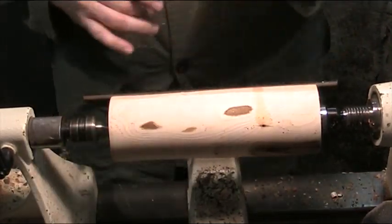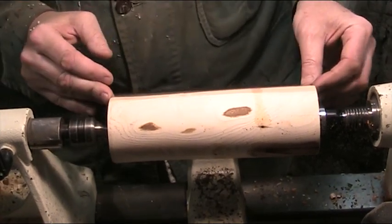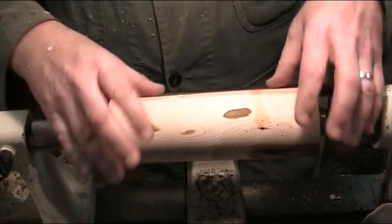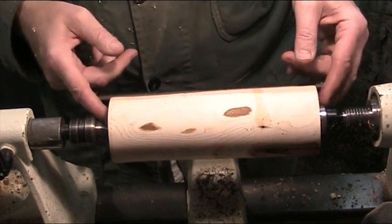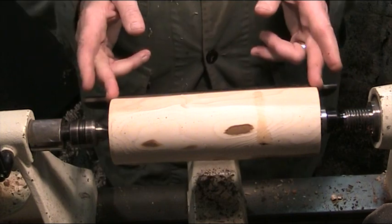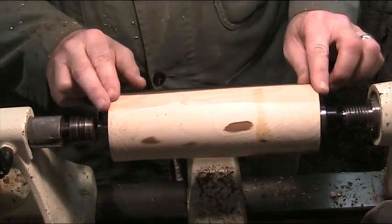And that's it. Now, one more wee thing I'm going to do. These ends are waxed, but I'm not going to re-wax them because we want the air, we want the stuff to come out this way. We don't want them to come out the ends. But the little hole I made for the centres is nothing. I'm not going to square these off, but maybe I'll square this one a wee bit, but I'm going to round these over